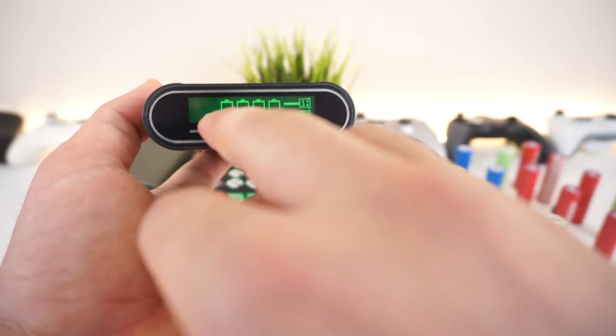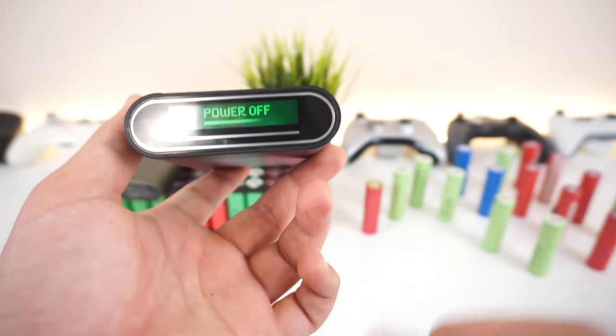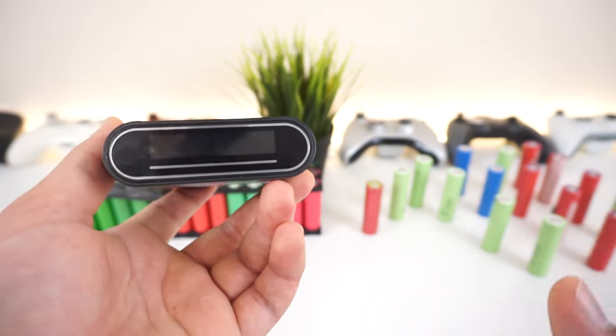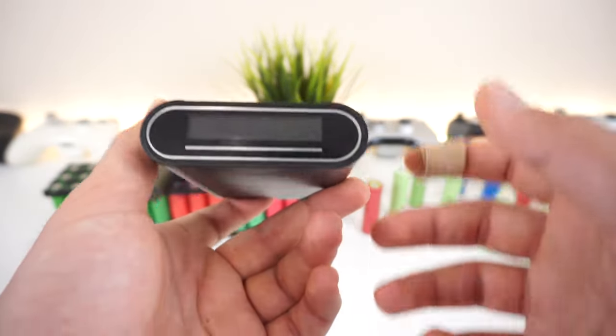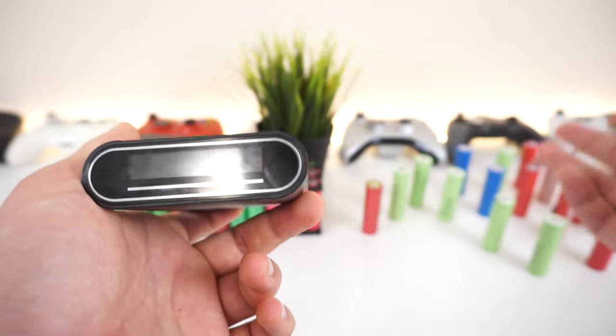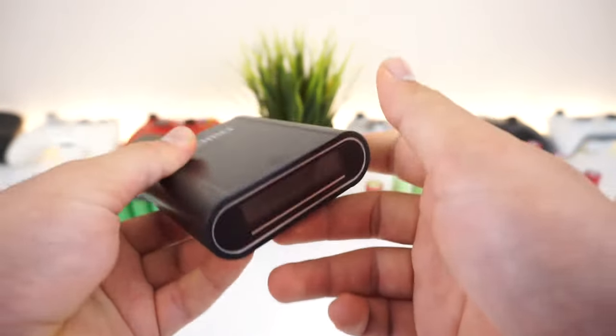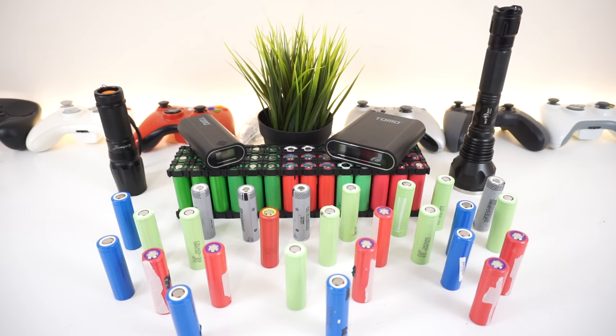You'll probably notice the batteries have dropped almost to 50% — that's because these batteries are not fully charged. They might look good on the voltage reading, but once you start using them they will drop down. This is why I recommend topping them off after you make them safe to use. Now you're probably asking where to get these batteries — from dead laptop batteries or power drills, or from friends, garage sales, Craigslist, used parts, or computer repair stores. Just ask if they have any dead laptop batteries they're about to throw away — they might be happy to give them away.